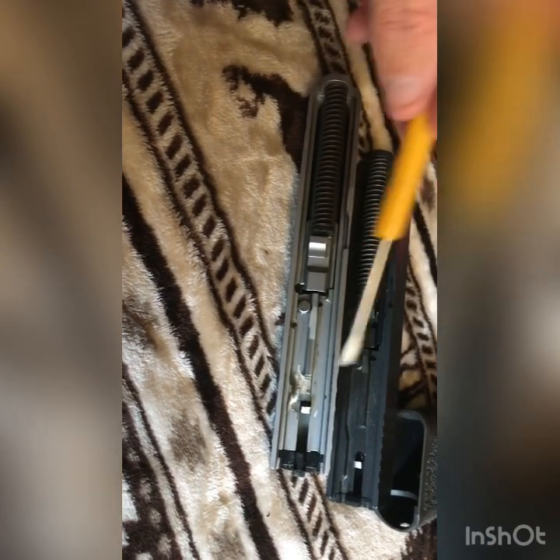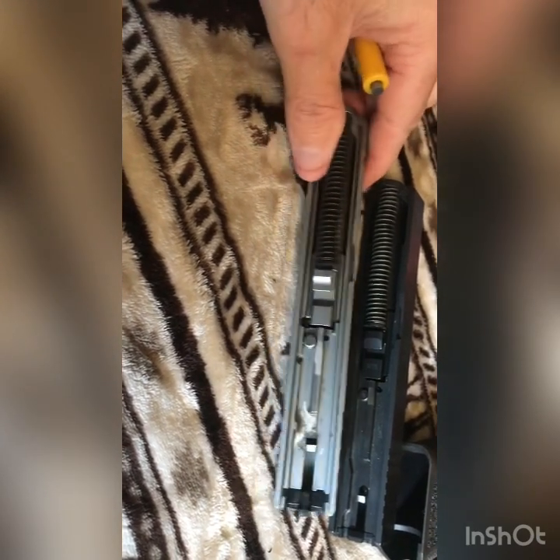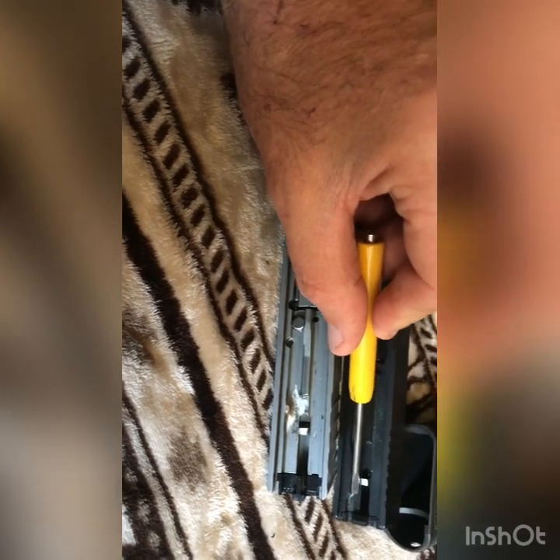What we do is grind this down with a Dremel. I know people are probably freaking out, but when you pay less than $130–$150 — we paid anywhere from $60 to $150 for the Smith & Wesson slides — you shouldn't be hesitant about grinding it. Just take your time. It has to be flush. On the Glock you have this little area where everything slides — that's where your rails are going to go.